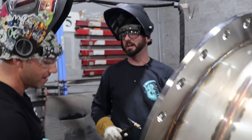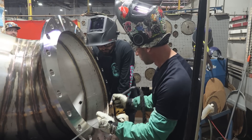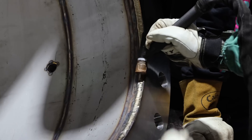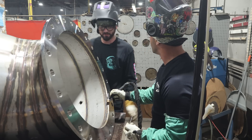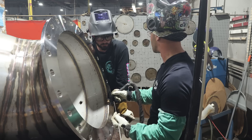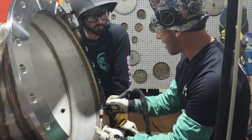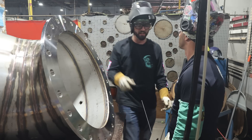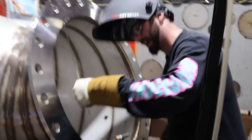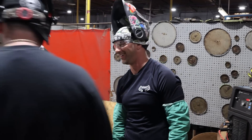I'm more into the walk-the-cup method here. It's a little tighter weave and more of a workout. When you freehand you've got too much to think about - controlling both hands and the foot pedal. With the cup resting, that takes all shake out since it's a fixed point. With the cup sitting on the piece, I don't have to touch the hot metal, and the filler wire is also a fixed point. So I can put all my brain energy into where that puddle is going - edge control. Stan prefers downhill freehand; I prefer uphill cup walk.